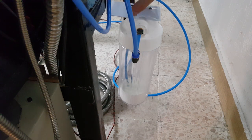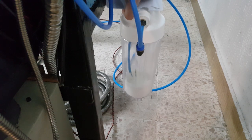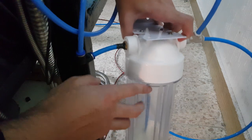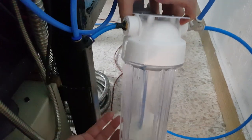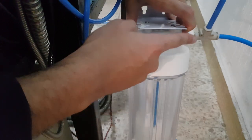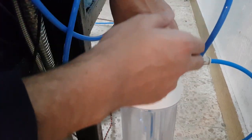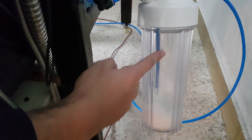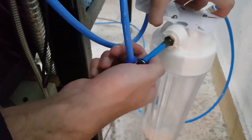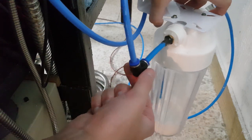And back here is my DIY mist cooling system. It uses a normal filter with a standard filtering cartridge. I split the incoming air into two paths: one is normal air and the second goes along a line to the liquid and comes out here. I epoxied it with metal epoxy.